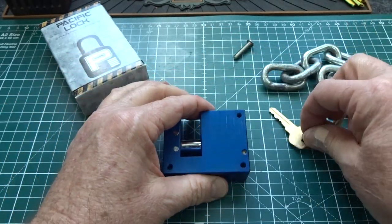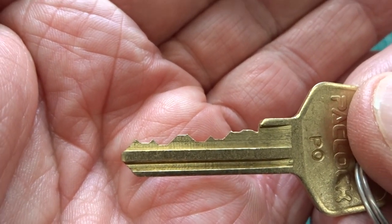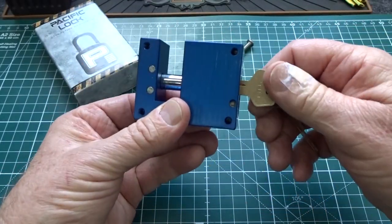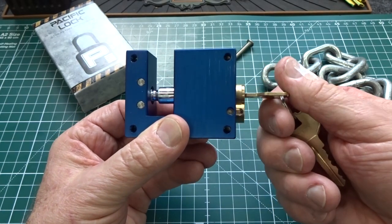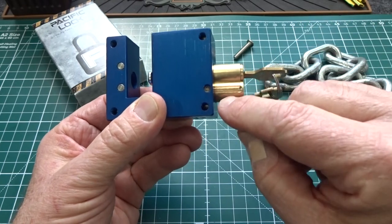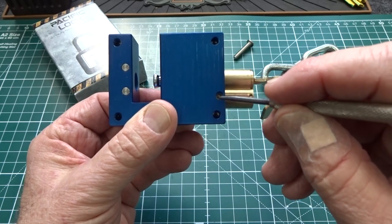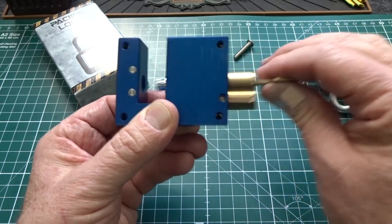Taking a close look, we're interested in the key and the lock itself. On the bright side it's got a six-pin lock, works very smoothly, rotates 90 degrees, and then the shackle comes out. When you rotate it you'll notice there's a little slot in the side of the lock with an inset Allen screw — this is typical of all disc locks. This is the way they hold the lock in place, retaining the core and keeping you from pulling it all the way out.